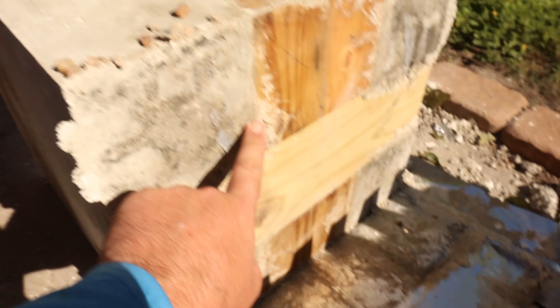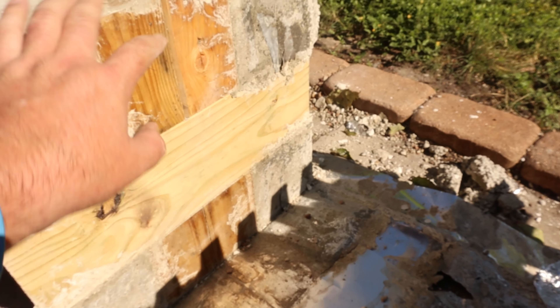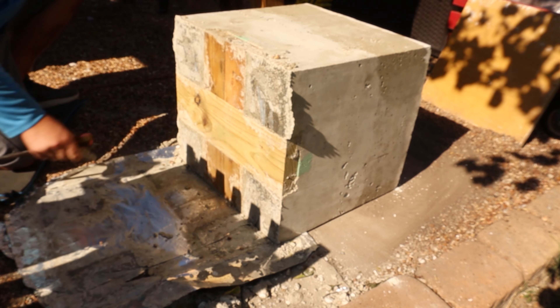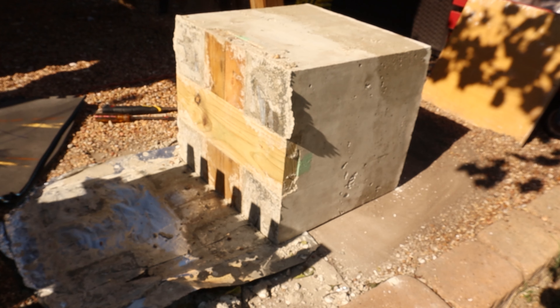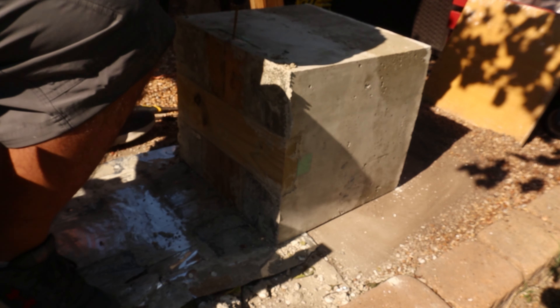On this part I tried to be very careful — when I built a planter before I cracked one of my feet, so this time I was going to take my time. You can see that board fits in there so tight because it's full of water and the concrete swells also. I first tried chiseling and hammering but it didn't work too well, so you'll see in a minute that I end up taking my circular saw and making some cuts to relieve some of the stress from the swelling.